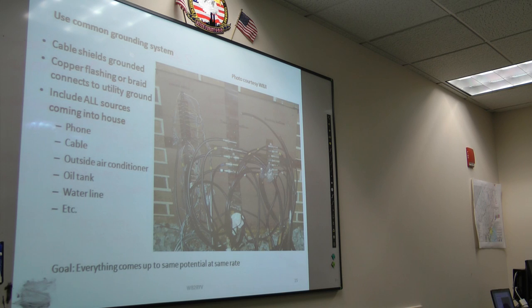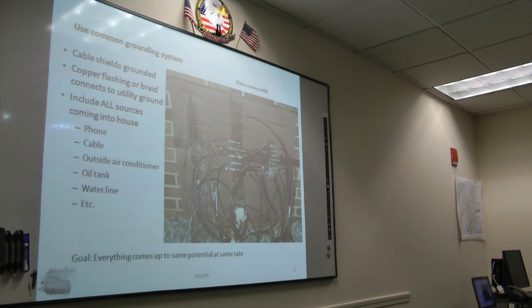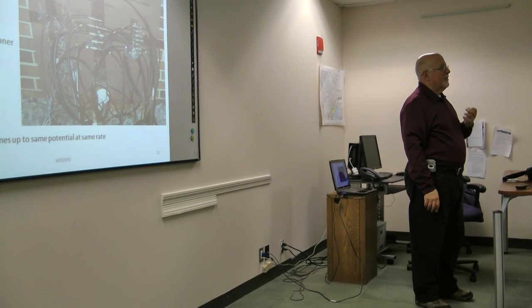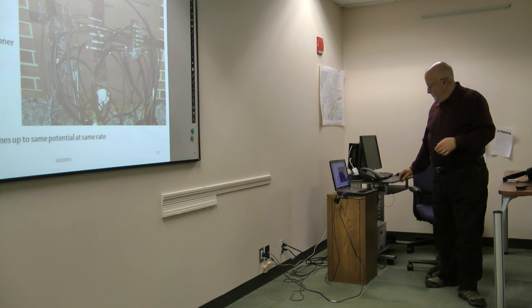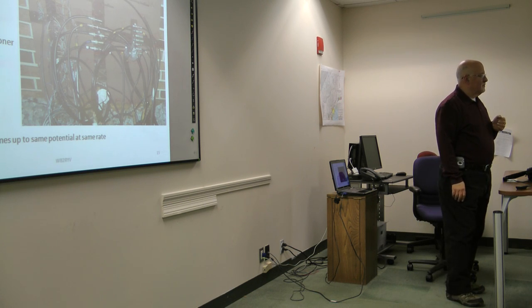And when you go down to Florida and look, there are companies that will protect your house. It's the same kind of companies, same kind of work that's done on things like Sterling Farms, the city's equipment there. The key is getting everything to the same ground point, and then a big farm of ground rods. And then if necessary, water, keeping that area moist so it's got good flow, it will dissipate the current quickly. John? Yeah. I've heard of chemicals being used in conjunction with that water flow.